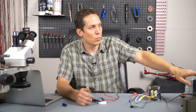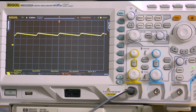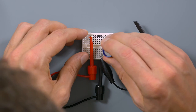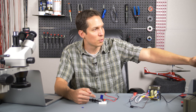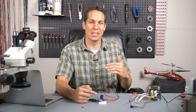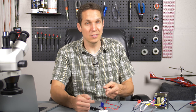Now that we've seen the 4.7 microfarad behavior, let's try the 2200 microfarad capacitor — that ripple should go away completely. Now that the 2200 microfarad capacitor is plugged in, you can see on the oscilloscope almost no jitter whatsoever — it's perfectly flat. It's a 15,000 ohm resistor, so that's a pretty small load, and that's a pretty big capacitor. One drawback of having a capacitor this big is it takes longer to charge in the first place. There are other ways to smooth the signal beyond just increasing capacitance, but this is a brute-force, easy way to reduce ripple.